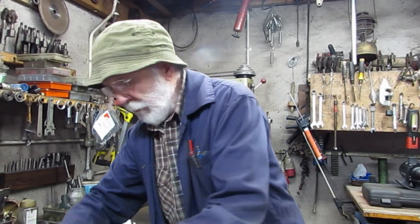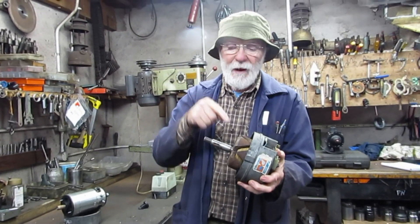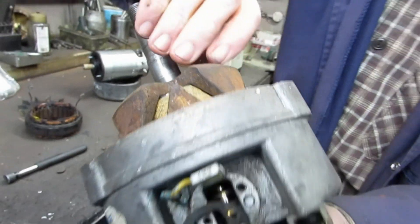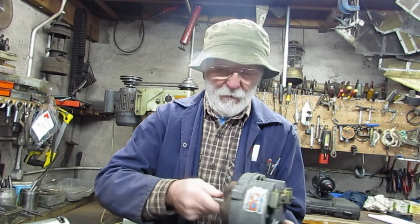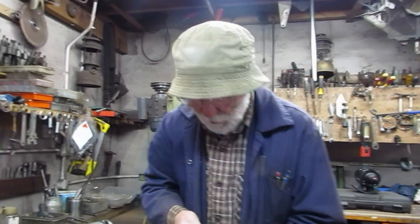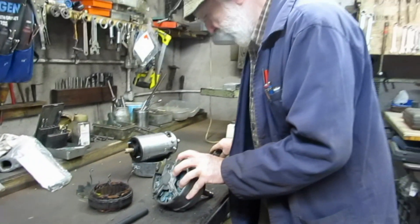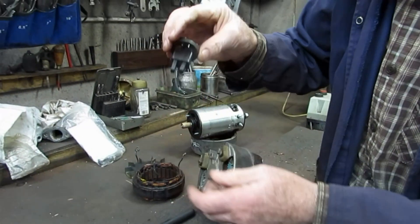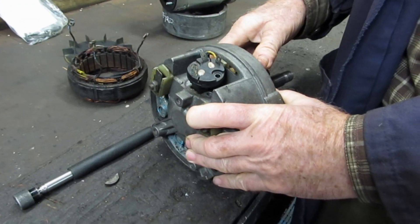In order to bring about this magnet in here, as I described in the second phenomenon, we have to pass an electric current through this coil in here — that's actually a coil of wire inside there. If we can pass an electric current in there, we can generate a rotating magnetic field. How do we pass current into that wire when the wires themselves are moving? We do that using these slip rings in here. We have these little carbon brushes here, so the electric current passes down through those carbon brushes, down into the slip rings and into the coil.